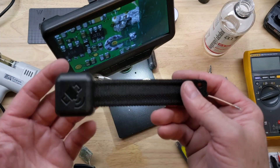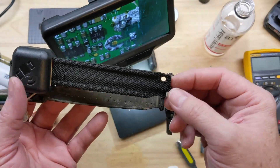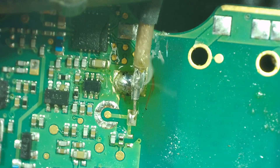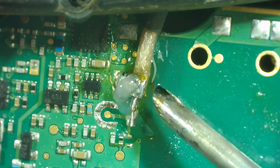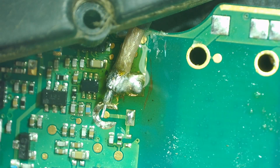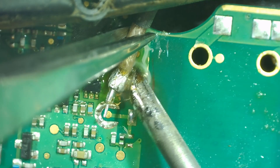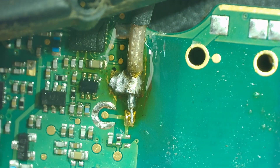Here's one of the GPS antennas my buddy bought to put on his collar. The coax wire was already prepped and stripped and had plenty of length, so if you had to strip it again you could. It lined up really well, which I like. I'm putting some flux on here to get the shield soldered on. I'm trying to hold it by the case but the wire keeps flopping around. So — just stop, let the solder cool, don't let it contact any SMD components. Get some tweezers with good grip, hold the wire, and let go of the cover. Now we're in complete control. I want to get the shield down and the tip in the right place for the signal — and there we go.